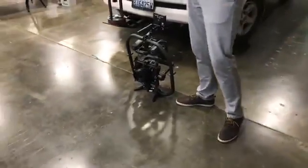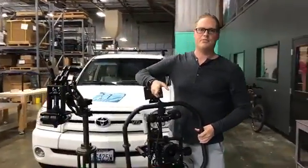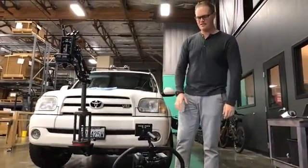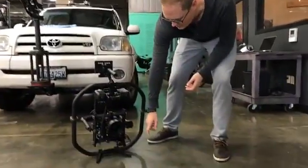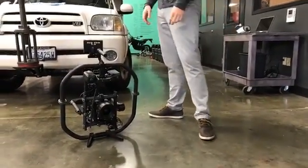And one of the design requirements when we were building this thing is we really wanted to be able to, when shooting, say, oh man, I'm tired and these people are taking forever to compose a shot, get the thing on the ground and go hands off quickly. So we came up with this technique where the ring is leaned forward a little bit, and we have molded fiber Zytel legs that clamp on and positively key into the ring. So the whole thing feels pretty stable and secure.